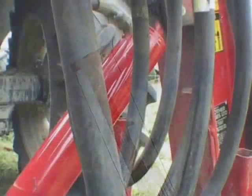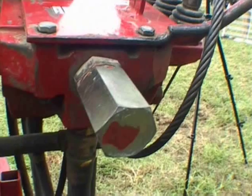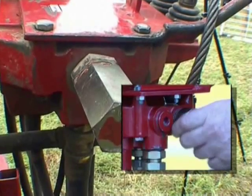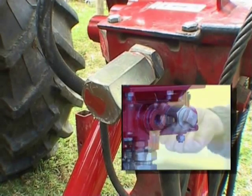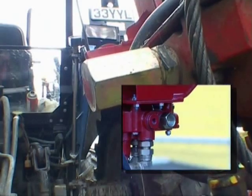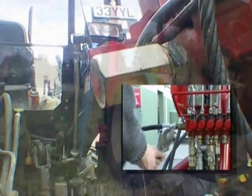The Kinghitter hydraulic system is unique. When the machine is delivered, it's always set up for an open centre tractor. But by taking off the small adapter plug and turning through 180 degrees so the long end of the nipple is in, it becomes a closed centre, as used in many John Deere tractors. The closed centre configuration also allows it to be used as a high pressure carryover, and extra valve banks can be added to the machine.